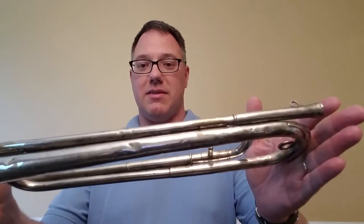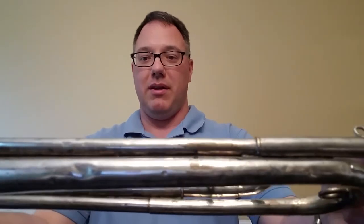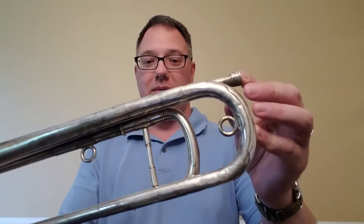It's been a little over an hour soaking and now we have something that looks like this. We've definitely done something — this is not perfect, there's still some tarnish and marks on here, but that is a vast improvement from the blackness we had previously on this horn. We also know that something has been done because if we take our piece of aluminum foil that was sitting on the bottom, this thing has turned a tinted orangey-brownish color instead of the original nice shiny aluminum foil silver color. That's all of the sulfides moving off and tarnishing the aluminum instead of remaining on our silver — so we know we've removed something and made it better.